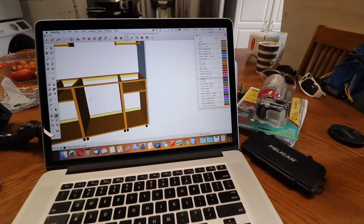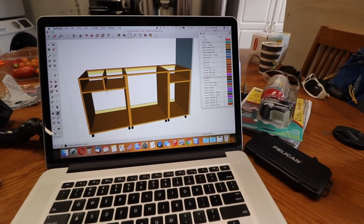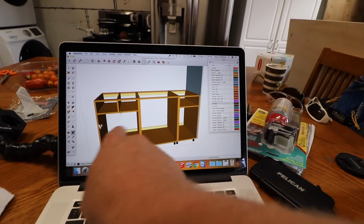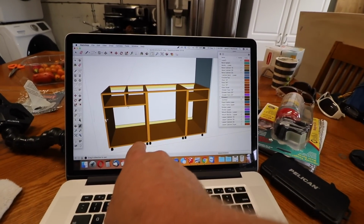If you had a frameless cabinet or a panel cabinet, they actually make wooden plugs that you can put into the hole, and then you can cleanly cut and sand off so that the hole that you drill is concealed. Kind of like how they do doweling with furniture and stuff like that. I think starting from left to right makes sense in my brain because that's kind of how we designed them. So let's start trying to put this 24-inch drawer base together.